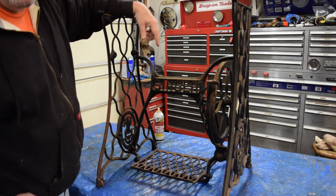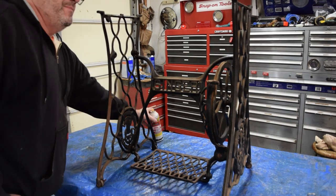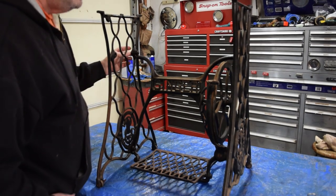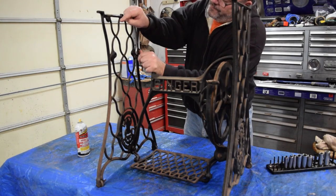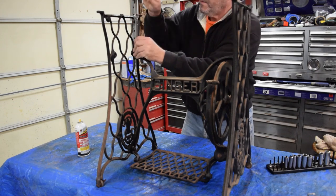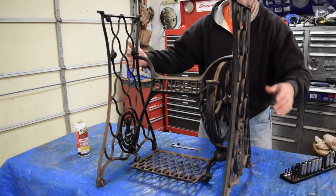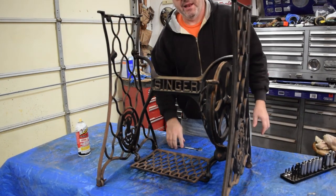Before lunch, I just came back from lunch, by the way, I sprayed all these fasteners with the PB Blaster, which is a releasing agent, which if they are rusted closed, should give us some help. So here we go. And that's a 5/8 nut there, by the way. I think I'm going to lay this flat.